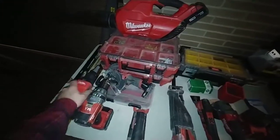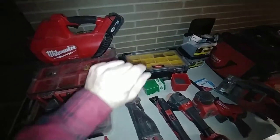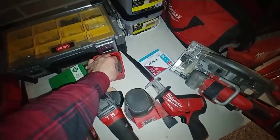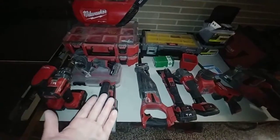So, little tiny screws, and the way the drywall screw gun works is it runs them in until it cams out and leaves them perfectly countersunk, and that only can happen if it's Phillips. Torx won't cam out, which is the beauty of Torx.